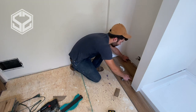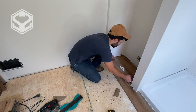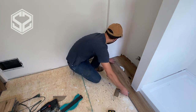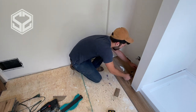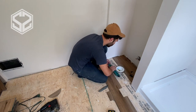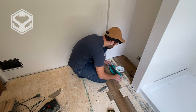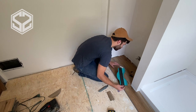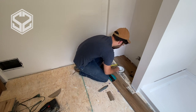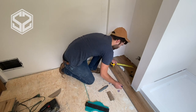It is recommended that you leave at least a quarter to eighth of an inch in between the flooring and the wall. This allows the flooring to expand when it gets hot and contract when it gets cold and not leave cracks along the edges. This doesn't look good now leaving a gap like that — you can tell it just doesn't look finished — but keep in mind we are going to be installing baseboard molding around the outside of the room and a quarter round molding in front of the shower and around the vanity to box it all in and finish it off.